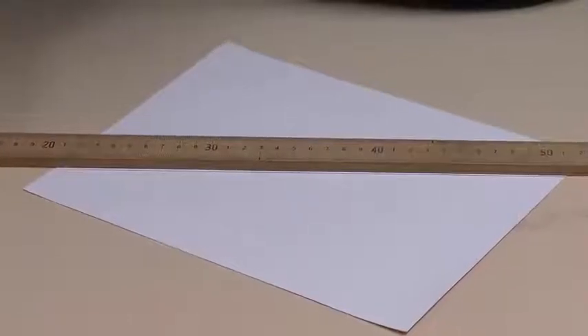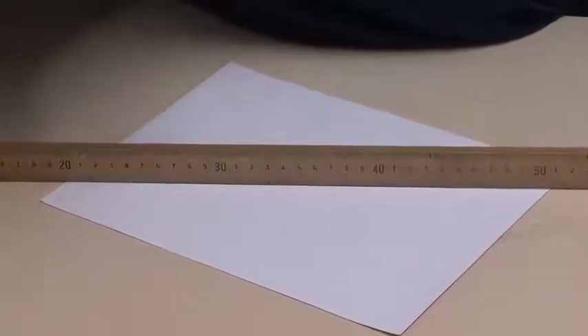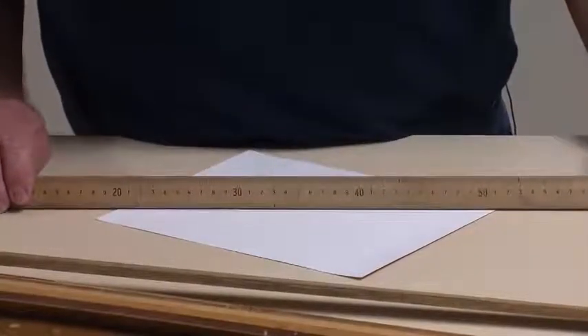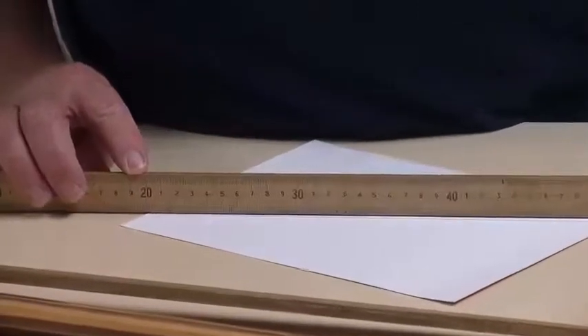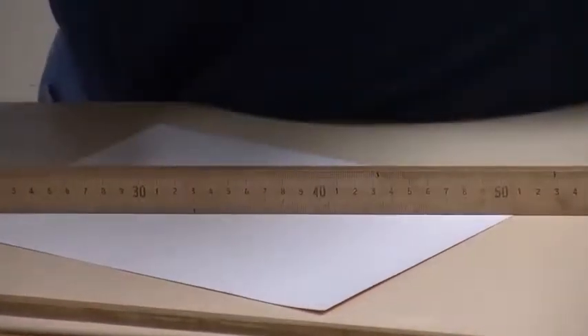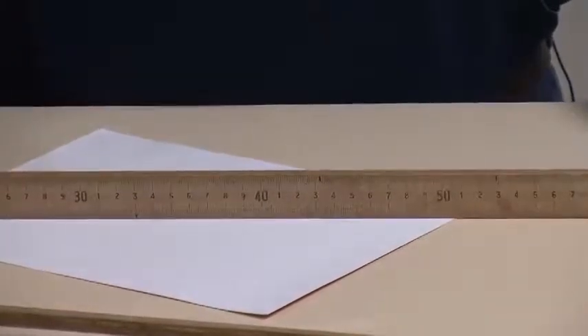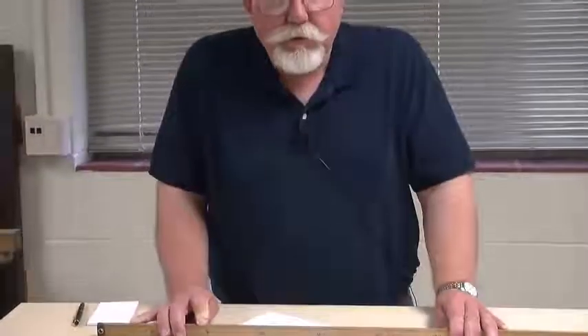The way to avoid this is to make sure that the marks are as nearly as you can place them to the thing being measured. So you always turn it up on edge like this. Let me measure this from say the 20 centimeter mark right here. And that places the other end at about 50.6. Another thing about measuring with analog devices is that you always mentally subdivide the smallest division into 10 parts and estimate to the nearest tenth. We won't always estimate the same tenth, but at least we do get one additional digit which is generally significant.